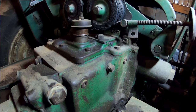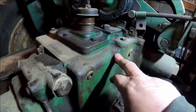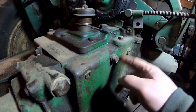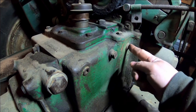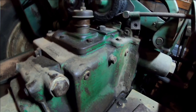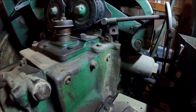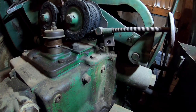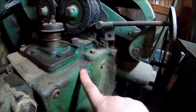Just like on the other video — cap this back off, put your priority valve back on, take this plug out. This plug becomes your pressure port; this goes to your loader valve or whatever external valve you're doing. The oil that would have normally gone along here is blocked, so it has to get back somehow. Oil comes out, goes to your loader valve, comes back into this port here, and resumes its path onto the filter and the remotes and everything. Honestly, I'd almost add another filter in, because you're going to be sending dirty oil back to your loader valve. The 1800, 1900 A and B series and the 1600 didn't have the filter until back here, so pretty much that easy — pressure out, pressure back in.